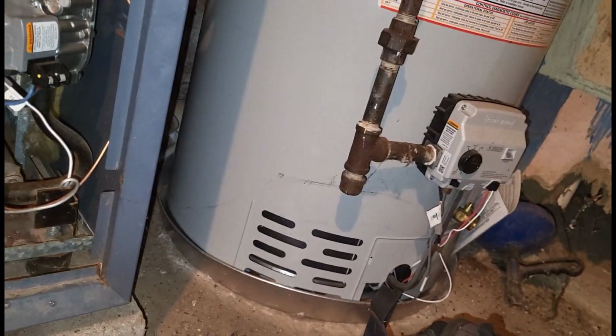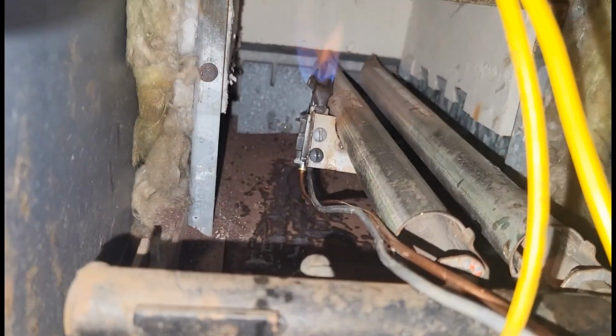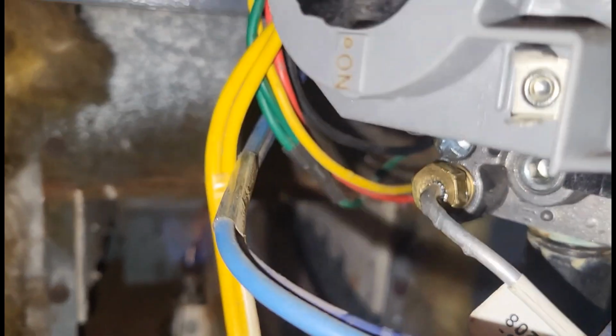And for two, you don't want to have any unburned gas leaking out of this boiler with other pilot lights near the unit. So that can be very dangerous. So guys, like I said, there's no benchmark time to wait. Just hit the pilot line, and like I said, you can give yourself 2 to 3 minutes. Maybe while you pack up, you just wait on it and come back, and then you'll know.